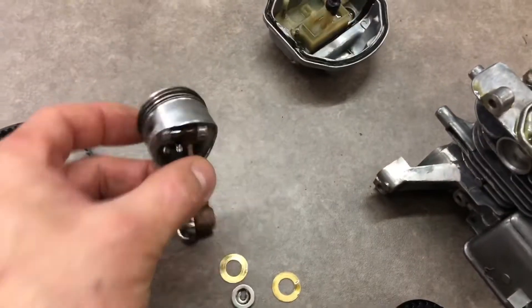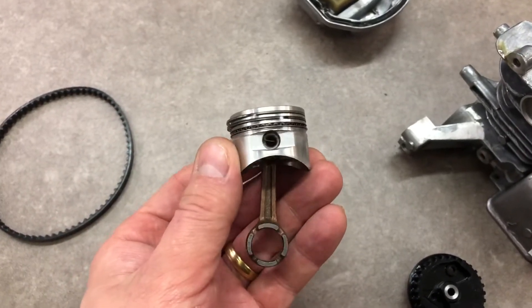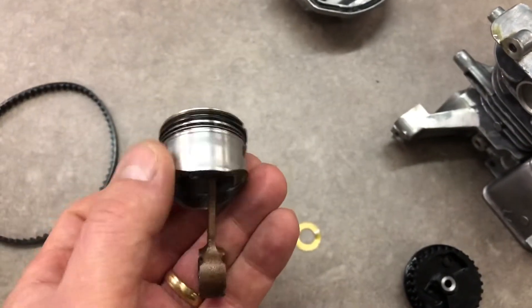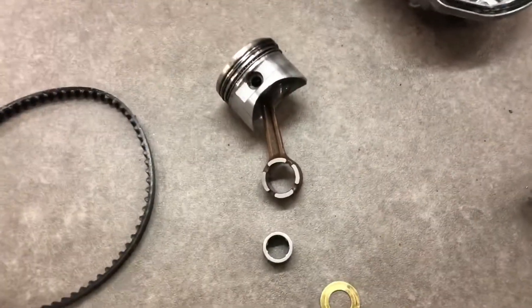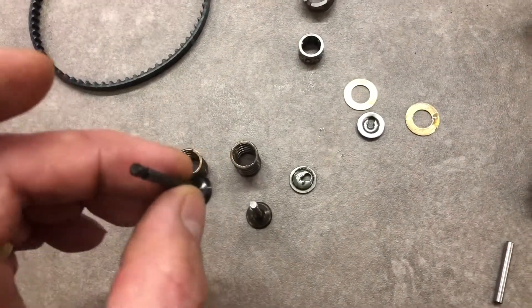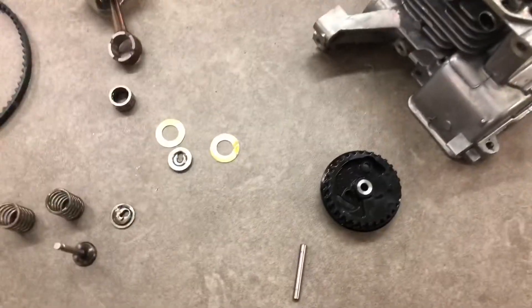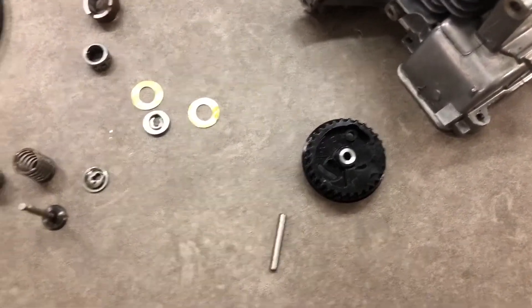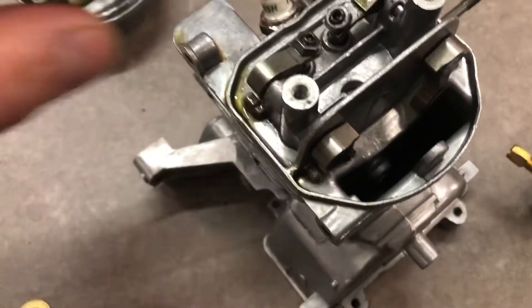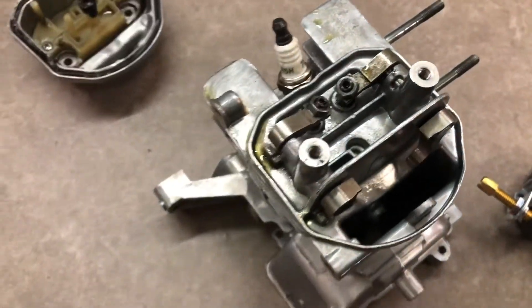This is the engine stripped. We've got a tiny 35mm piston with rod — quite a good design, quite light — two compression rings, one oil control ring, and a conrod. There are tiny little valves; that's the exhaust valve and springs. As a V12, buying two of these gets me lots of parts I won't need to make. That's actually the cam, which is just a single lobe, and it uses two finger rockers to push one valve at a time.